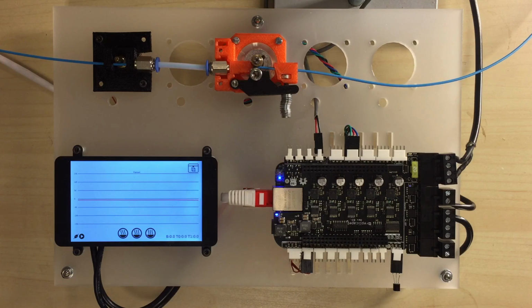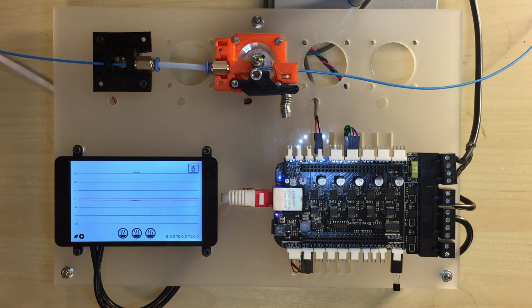And so what you'll see is that this makes it sort of a debit credit system. So you have the extruder sort of saying push 1 millimeter of filament, and then you have the sensor saying okay, 1 millimeter went through there. So you have sort of a debit and credit system where it keeps tabs of it, and then if there's a deviation, then that is recorded and accumulated.